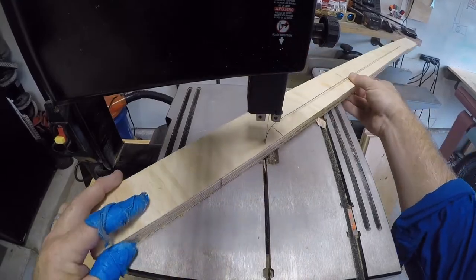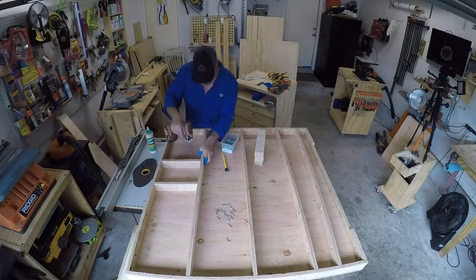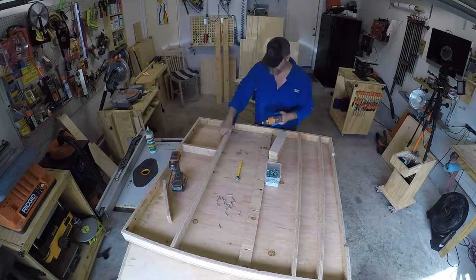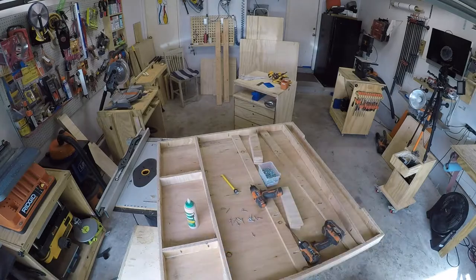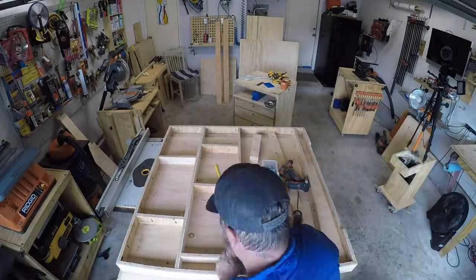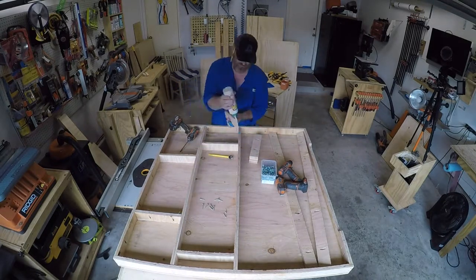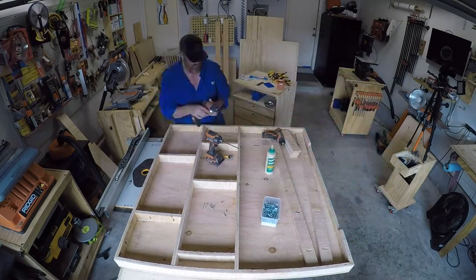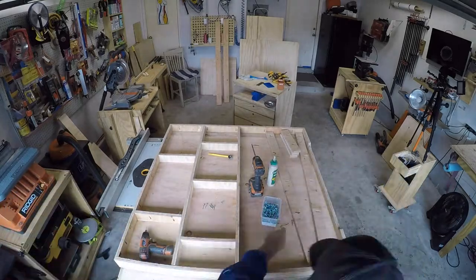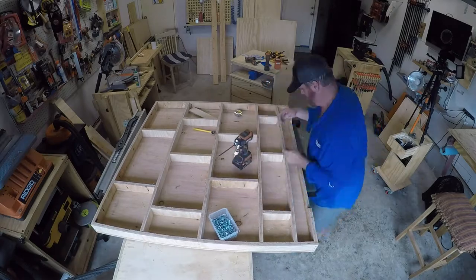I'm going to cut and sand a notch out for the front rail of the table so it's kind of like a handle when I pull it up. While assembling this front table, make sure to leave enough room for your drill — you're going to need to drill your carriage bolt holes in, and if your blocks are too close, you won't be able to get your drill in. I also left room here for two 1.5-inch 2x4s for legs that would fold out.